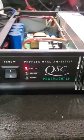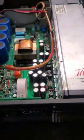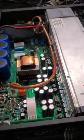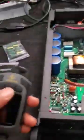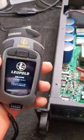The amp comes on, turns on, looks normal. Flick the switch — it goes out of protect, goes on to power. This is normal operation. The amplifier will actually play both channels, no problem. But as you leave it on, it's going to start to demonstrate its issue. It's going to overheat and turn off. So let me fire up my little thermal imager here.